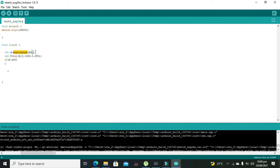We first read the analog signal on pin A0 and store it in variable d using the assignment operator. Variable d is then mapped: on the x-axis it is mapped up to 1024 and on the y-axis it may have up to 256 values — like a resolution. In one second, 1024 samples of d are observed. So if f is greater than 200, we write Serial.println with the moisture content message.